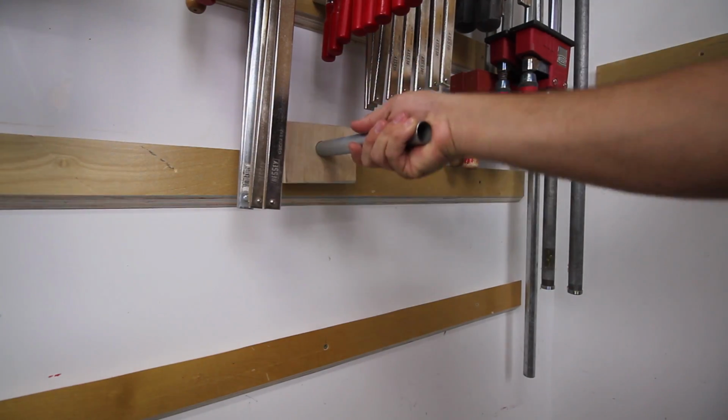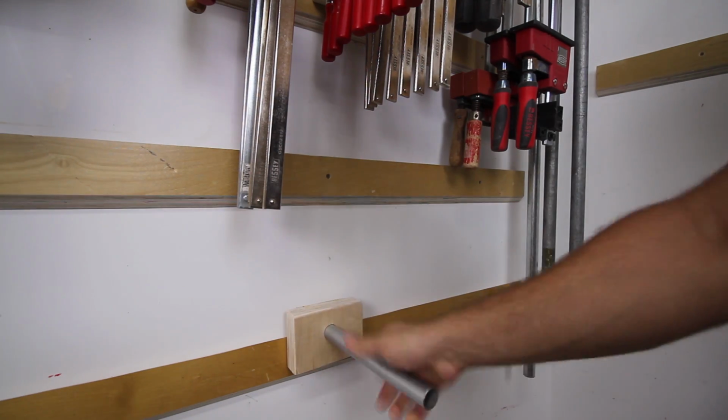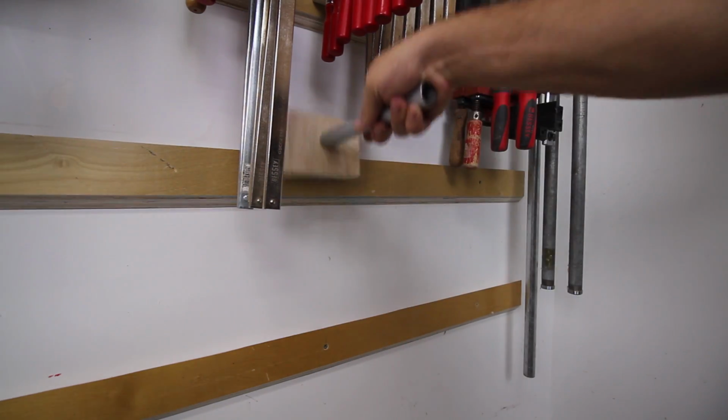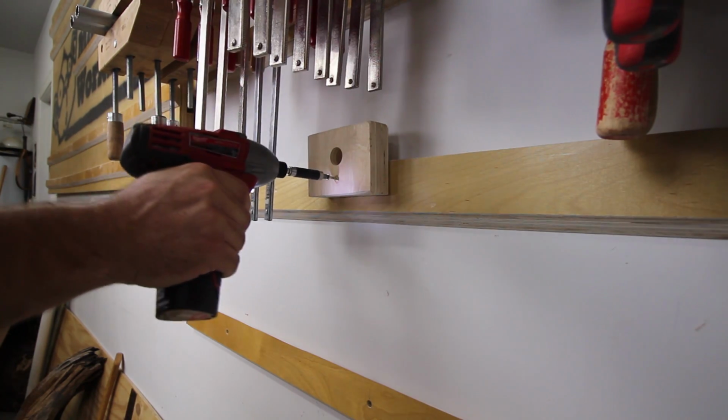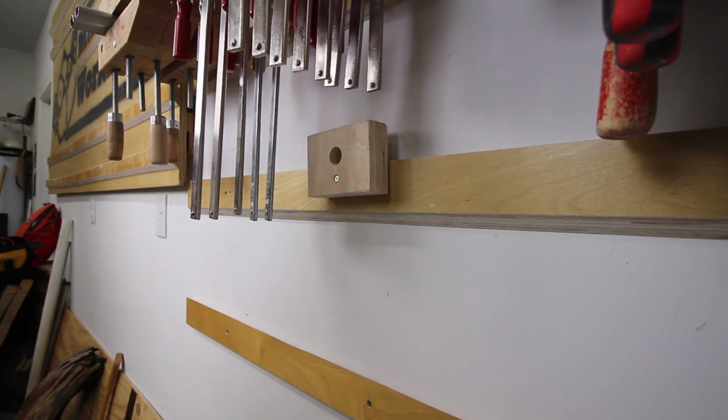Another one of the issues I mentioned earlier is to try not to sand the cleats too much. This spot was sanded a little too much and the French cleats slip off as soon as a small amount of weight is applied. Making the individual blocks a little longer would probably help out with this, but driving the screw into the cleat will also work.